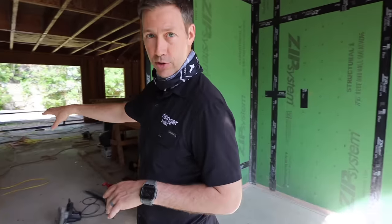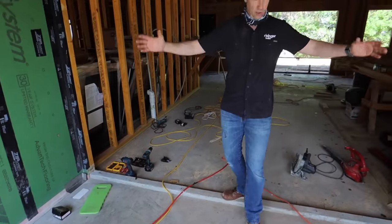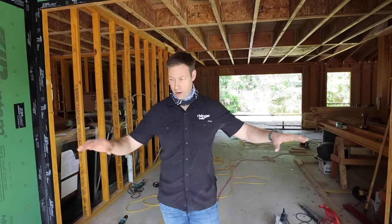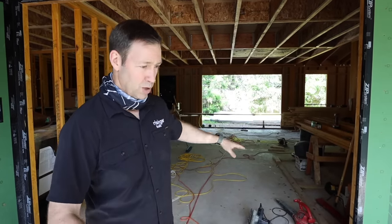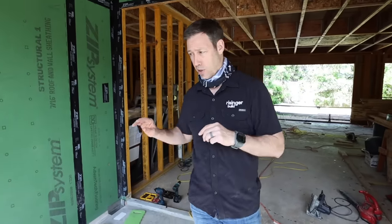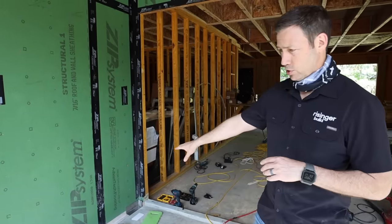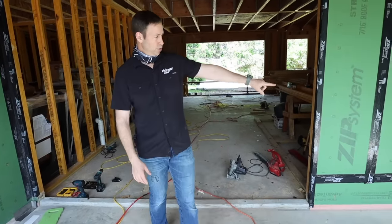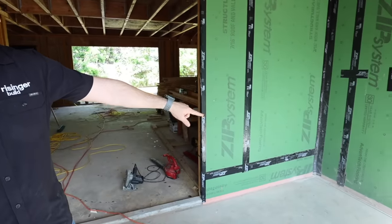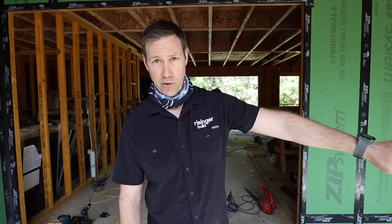This is the house here. At the front porch, I've got a curb that I poured right here where the front door is going to be installed. This big opening is for my front door, and I've got a nice generous size front porch. But because the slab height was here already, when I poured the front porch and the garage slab was over here, I was a little bit constrained on elevations. I couldn't get as much slope as I wanted out of the porch. I also have only just a little bit of curb on the rest of the house. I poured this taller curb here, but if you could peel back the walls, you'd see that I only have three quarters of an inch or so between this concrete porch and my slab on the other side of this wall.